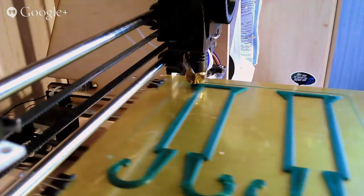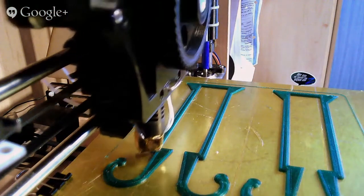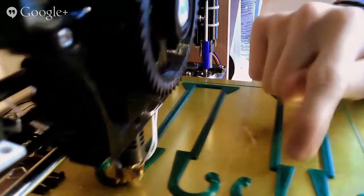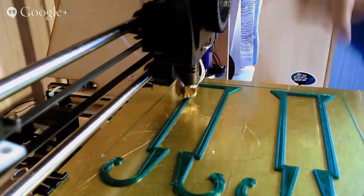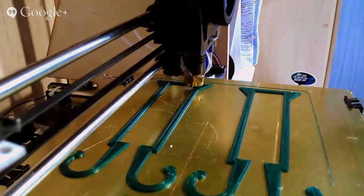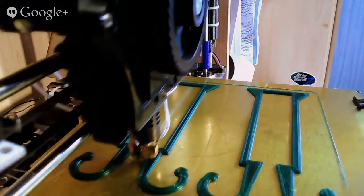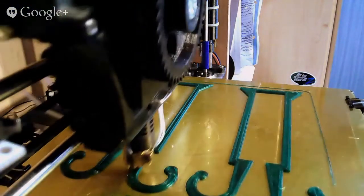Right now, hopefully, we're now going to print something called the infill, which is going to be quite interesting for people watching here. Basically, now what's going to happen is it isn't going to print solid. You see that it's always been printing like all the way down here, and it's been a solid. This time it's going to print the honeycomb structure at a 1% infill, which actually I probably should have done at about 2 or 3% infill, but never mind. But I've done it at 1%.